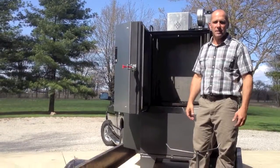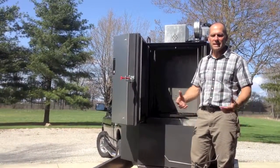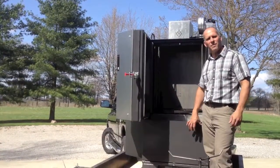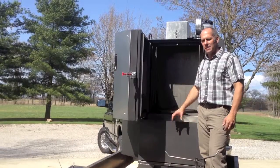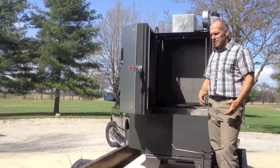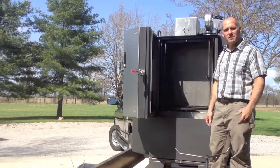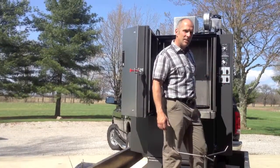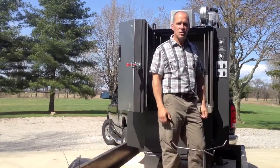When you clean parts with solvent, eventually the solvent gets dirty and has to be hauled away — we're talking about oil buildup to the point where it's saturated and doesn't cut well anymore. A typical solvent tank might be around 15 to 20 gallons of solvent. Here in one of our smaller machines, we have 55 gallons of water, so it's going to take a lot longer for that saturation to occur, but eventually it will. The nice thing is oil and water don't mix, so at night when your machine cools down, that oil's all going to float right to the top. At some point when it's time to get rid of the oil, top the machine off with water, make sure it's full, and go home for the night. In the morning, all your oil's floating on top. There's a skimmer built inside — just put a drain container at the back, open up the spout, hit the button for your skimmer, let it run for a half hour or an hour, and you're back to having nice clean solution, ready to clean.